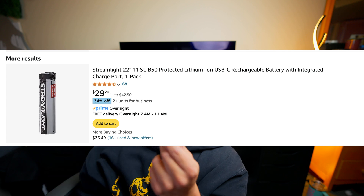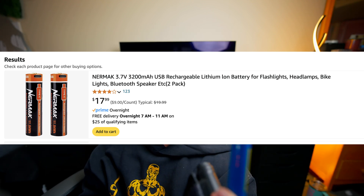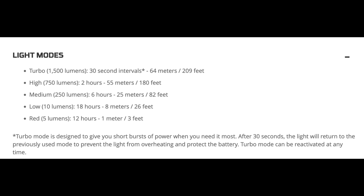Some of the drawbacks I found are that these 18650 USB-C cells are very expensive and hard to come by, especially good ones. Oftentimes you'll find super junk, crappy ones on Amazon that don't even work and especially don't work in the cold. The other drawback of this light is that with this battery it only lasts about two hours, and I'm often in the middle of nowhere photographing all night. Also, this is 1500 lumens as advertised, but that's on turbo mode, and turbo mode lasts only 30 seconds. The normal high output is 750 lumens, so it's not crazy bright — I still wanted something a lot better.